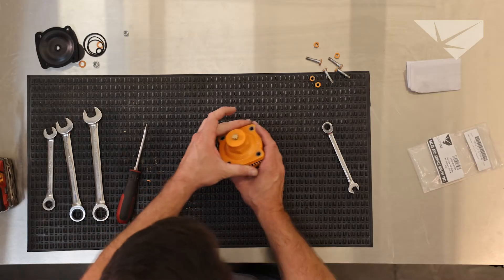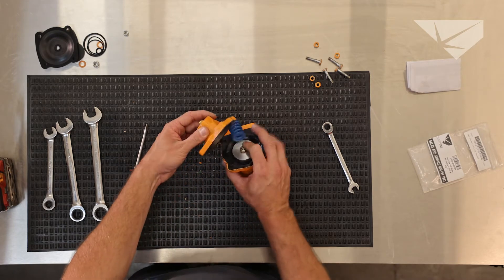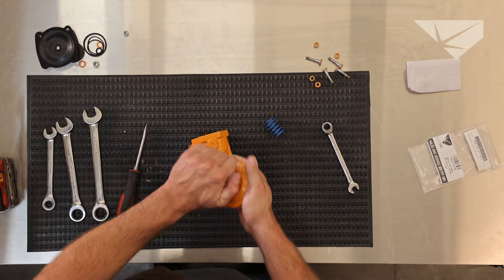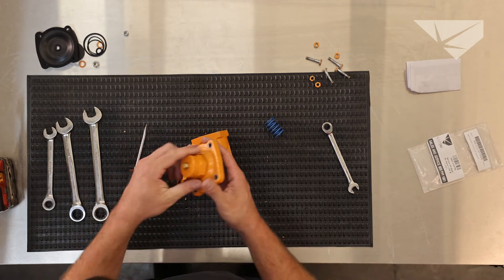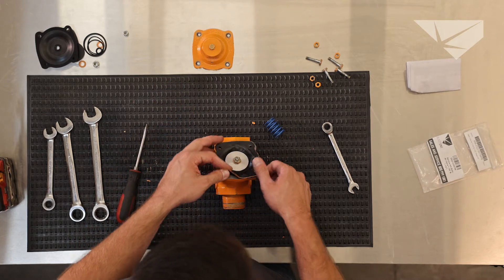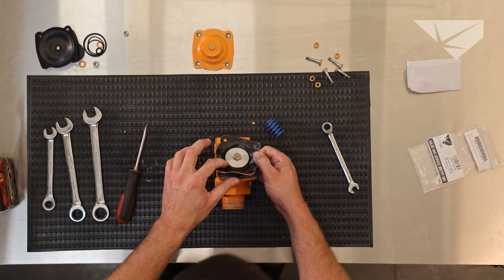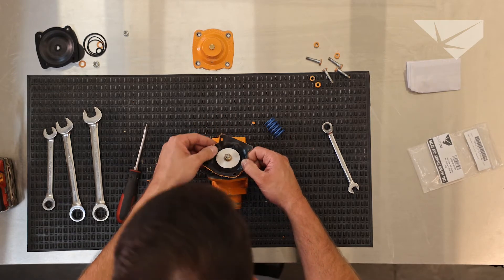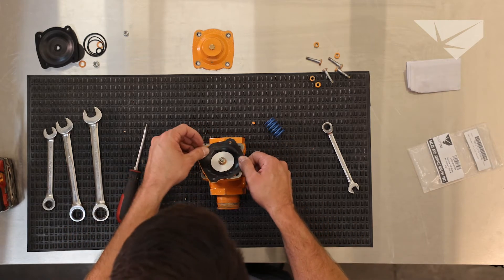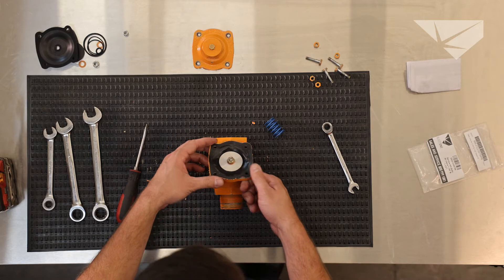As you see when the top housing comes off, there's a brass breather vent, a spring cap which does have an o-ring underneath but typically does not need replaced. And you see the diaphragm — this is where you're going to want to inspect for any kind of wear or tears. You'll notice sometimes it's bubbling up or maybe it's just a stress crack. Any leaks in this can cause the valve to function improperly.